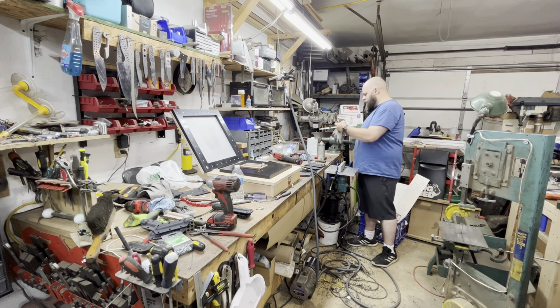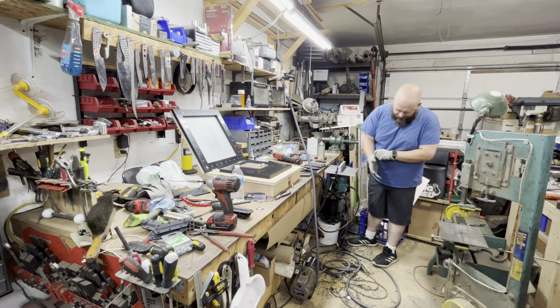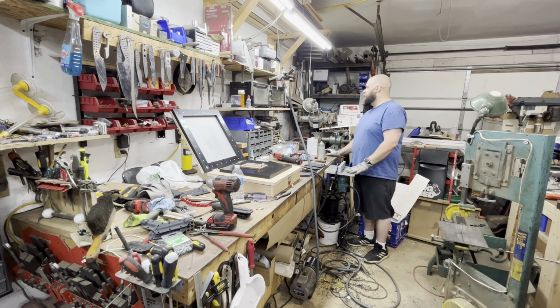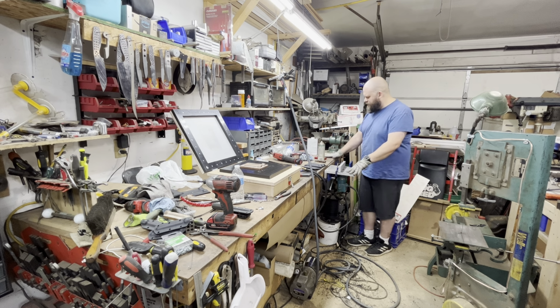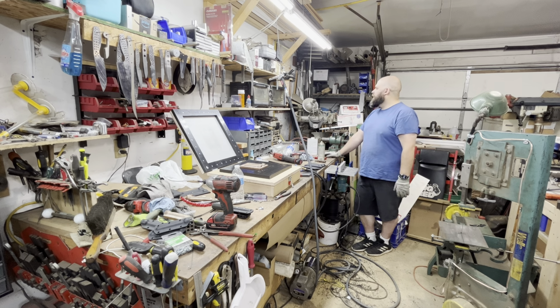So I'm going to go ahead and get some gloves on. Again, this is 350 degrees. We're pulling out of there. It will blister you. You've got about 30 seconds to go. I've got, I think it's a 6 CFM vacuum pump that I use for HVAC work. That's what we have hooked up to my press. I'll show that in a little bit more detail momentarily. We've got about 15 seconds left. And again, I'll tell you guys about a quick lesson learned while we're waiting for this to cool after we press it.